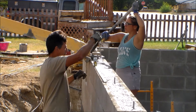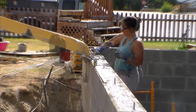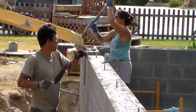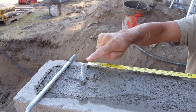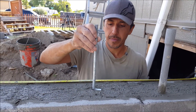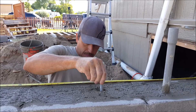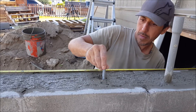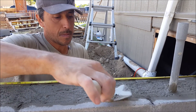Here I'm finishing the grout flush with the top of the blocks, then installing anchors every two feet. Let's take a closer look at setting one of the anchor bolts. This is a half-inch galvanized concrete anchor bolt that's compatible with all types of treated lumber. To set the anchor bolts, I have to do it while the grout is somewhat fresh so I can set it inside the grout. I wiggle it down to where just the threads are exposed above the top of the grout — it doesn't have to be set perfectly, but should be consistent with the other anchor bolts. After getting the anchor bolt into position, I grab my trowel and finish the edges where I just placed the anchor.